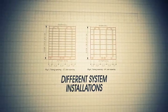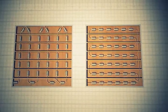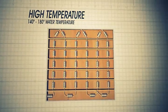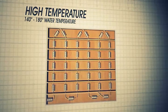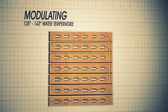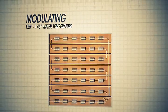One of the best features of the UltraFin system is its flexibility in working with different boilers. If you're using a high temperature boiler, your layout will need the least amount of fins over the total area — this is called the UltraFin high temp system. If you're using a modulating boiler, your layout will use a few more fins over the total area to increase heat distribution for the lower operating temperature — we call this the UltraFin modulating system.